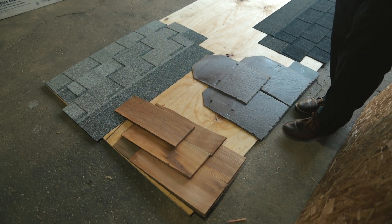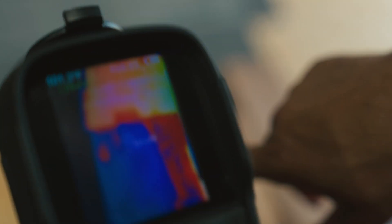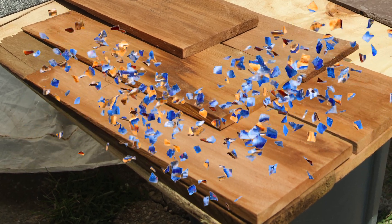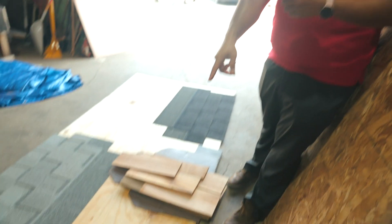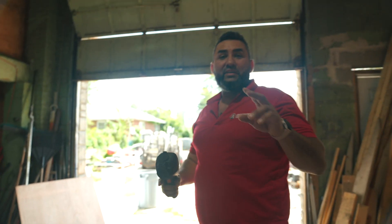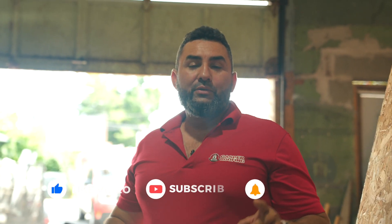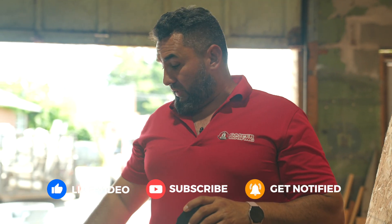And underneath the cedar shakes — let's move the whole section to the side — you can see the blue on the camera: it's 101°. We've got our winner. The cedar shakes don't transfer the heat down to the plywood. There's a 47-degree difference on the plywood between the shingles and the cedar shakes — 100° under the cedar shake versus 147° under the shingles. If you like this type of video, please like, comment, and subscribe. New videos every Sunday and Wednesday. Don't forget the bell. Let us know in the comments what type of roof system you have on your house.